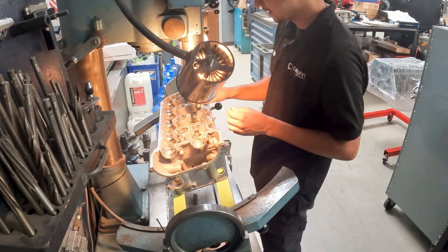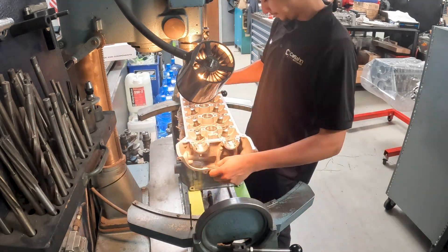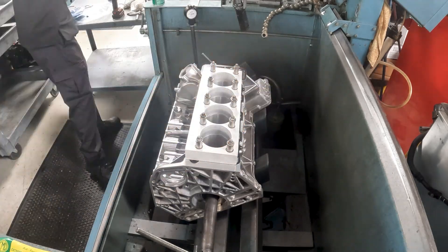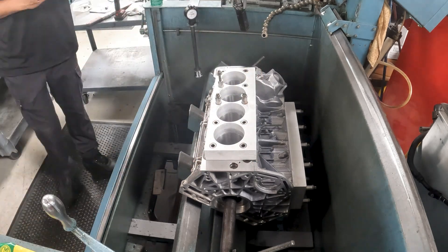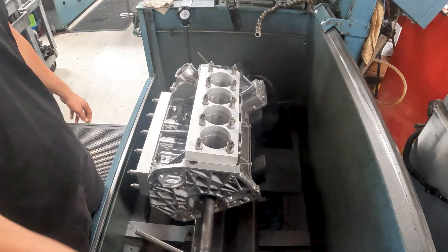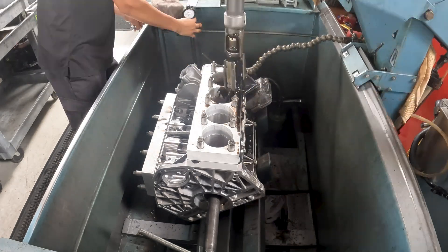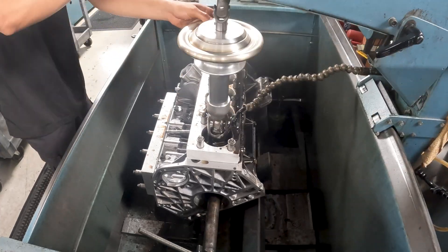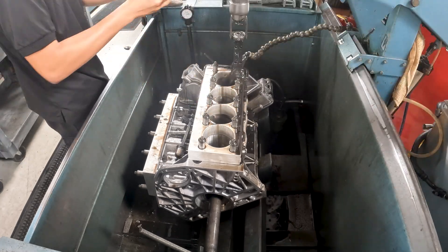They're going to pull all the plugs and borescope all the cylinders, clean and inspect all the parts, and go through all of that process before the machining process starts. This is part of getting an engine back to square one. The block gets decked, they bore the block, chamfer the cylinders, clearance the lower parts of the cylinders and the main web for the hone overstroke, then wash the block and clean everything to get it ready for all the special parts of the 4.6 liter motor.